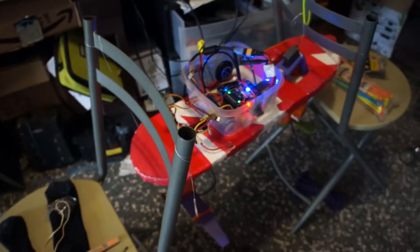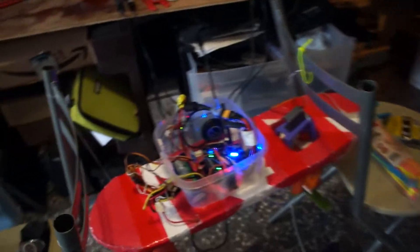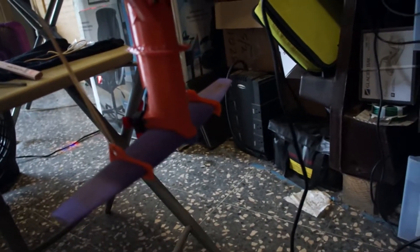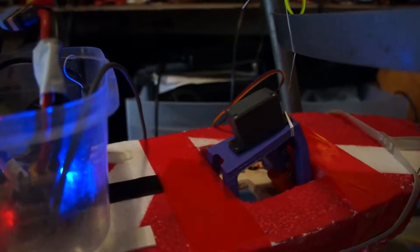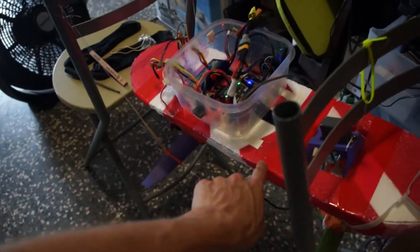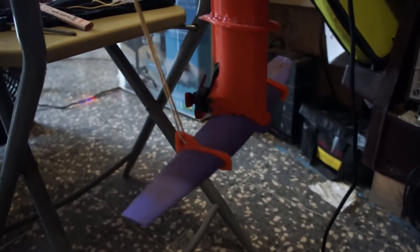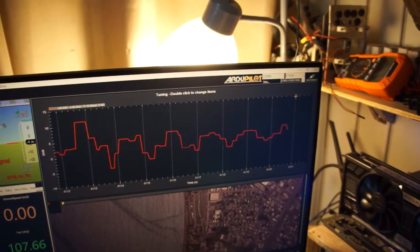Here's the torture rack. We got one rubber band — she bounces real good. I've been disturbing the system like this, and it's designed to mimic how it's done in the water. I got one on each wing with these little holders I made, and up here I just got it around the front servo mount. You can see the boat wobbling — that's my disturbance to the system — and then the servos actuate the wings to stabilize the roll axis.